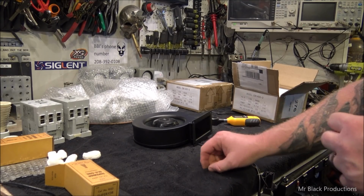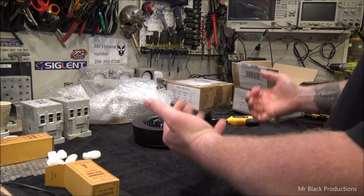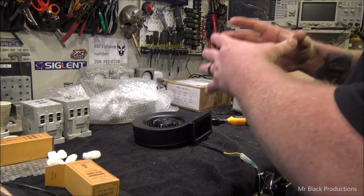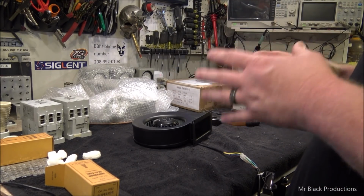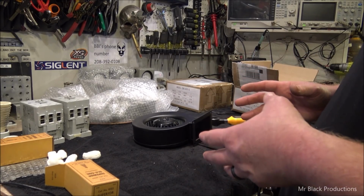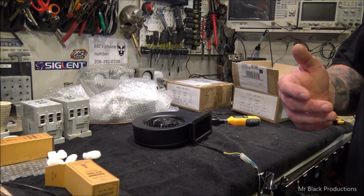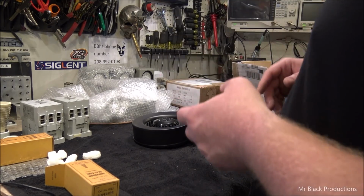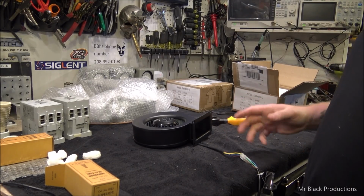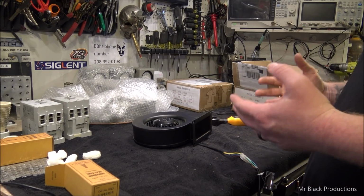Now I am going to put a lift fan at the top, but not as aggressive as Vader, because the way I got Vader set up is that the internal guts have vents all the way around the bottom, and then there are blowers that push air all over the different parts. But the very top lift fan is a sealed system. It was designed to go into the corner of the room and have an exhaust stack attached to it, a minimum of 12, 14 inches across conduit to go up, so there's very little airflow, but the idea is to pull cool air in and then exhaust the heat out the top. Where this one, we're not running with such high temperatures, we don't have to move so much air, it's not as big of an anode.